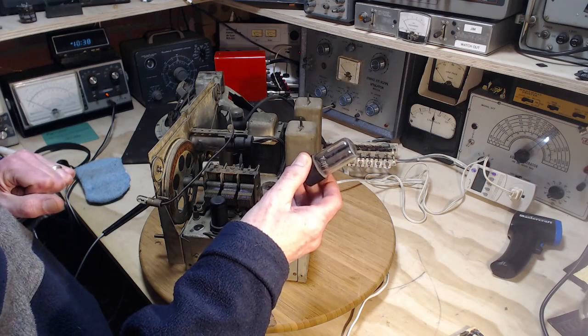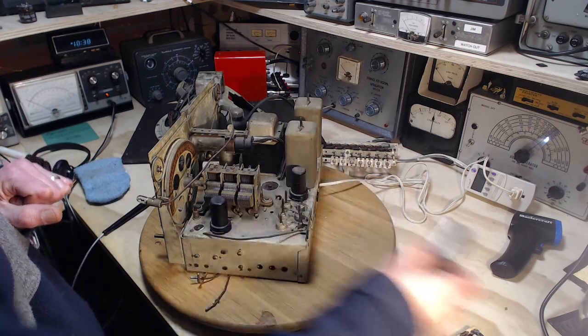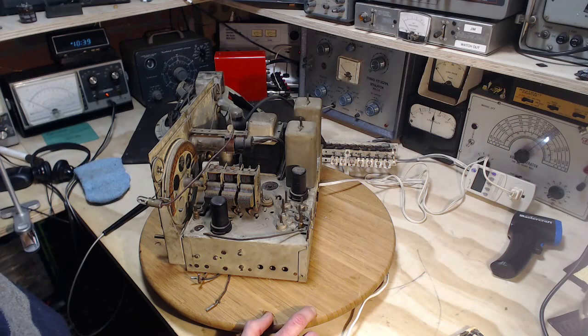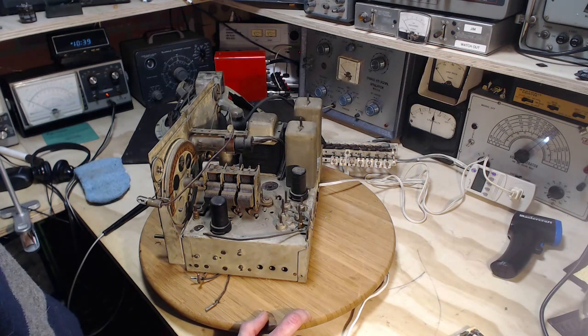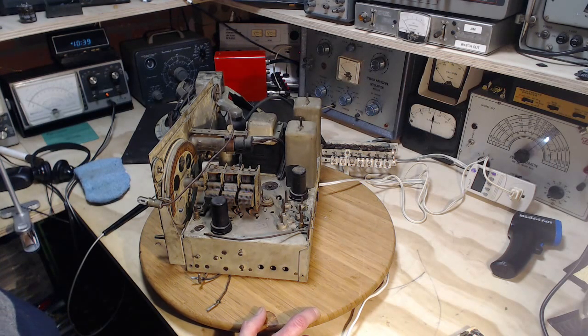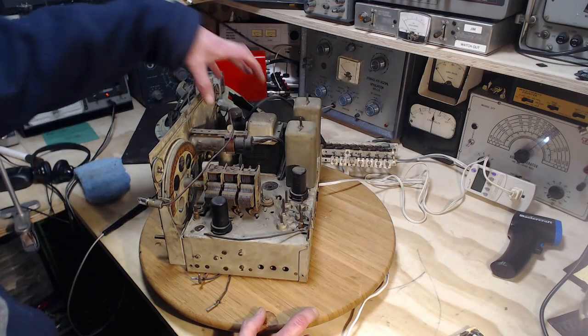I think it's too hot. I think that's too hot. Lots of capacitors. You could have tube biases that are incorrect in here now. Tubes conducting more current than they're really supposed to. Lots of problems stemming from those bad capacitors. So even though I can't put my finger on exactly what is happening, I think we got to start changing out some capacitors, and it's pretty important I get the right schematic, especially for this.